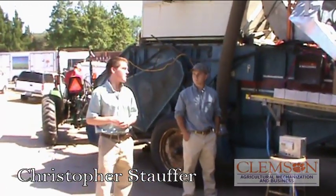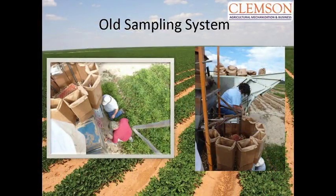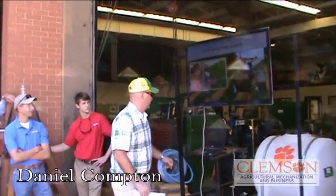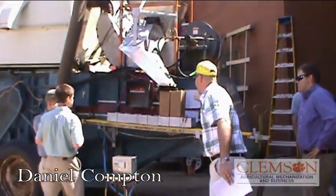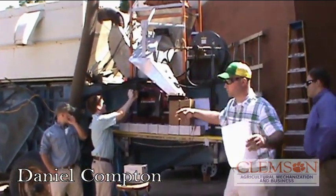Here's a picture of the old system. You can see the carousel and a person actually on top of the hopper sampling system on the back of the harvester. The hazard is they're sitting in a chair that's not strapped to the system — about 5 or 6 feet above the ground — so at any time they could hit their head on the ground. This is a picture of where they had the paper sacks inside these boxes, which came from the old system. We also tried to eliminate that second person, because we wanted one person operating the show instead of multiple people.